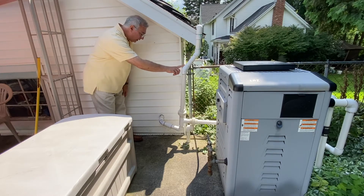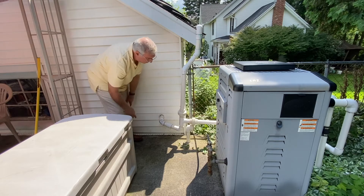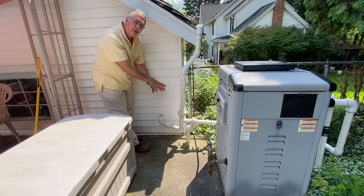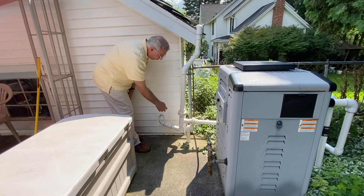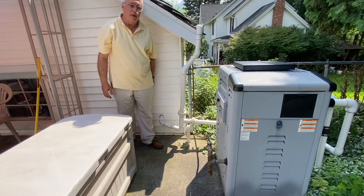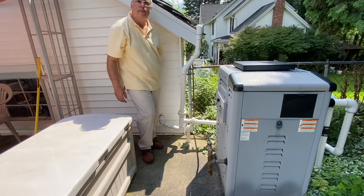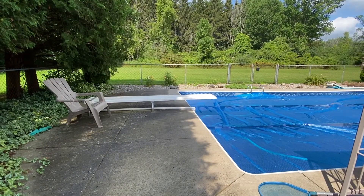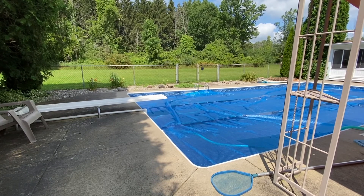Here is where the water returns from the bottom of the solar heater manifold, or comes from the bypass when the solar heater is turned off. We have fittings here that can be disconnected in the winter so that we don't have water trapped in the system and it doesn't freeze and burst the pipes. The water comes either from the solar heater or from the bypass and heads out and around, into the propane heater — which is normally off in the summer — and then out under the diving board and into the pool. We also have a solar heating cover that keeps the heat in the pool when we're not using it.